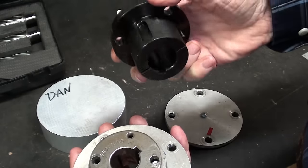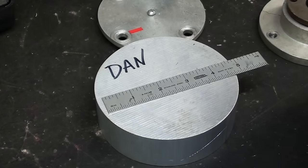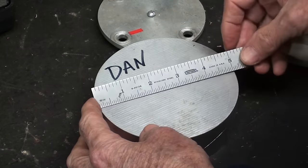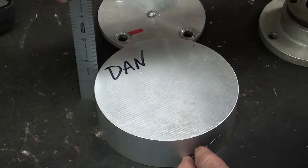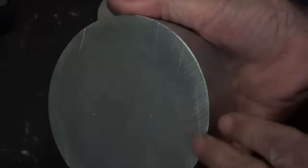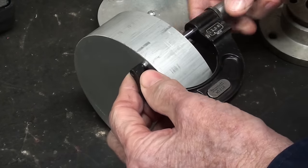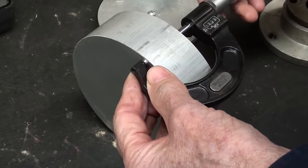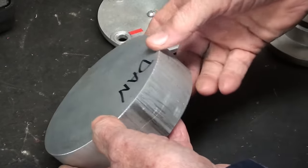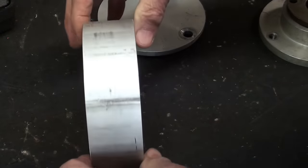He's got a new one of those too. One-inch shaft, and that's a three-degree taper, and this came from Grainger's. I'm not sure where Dan bought this aluminum, and I do not know what alloy it is, nor do I care, but it's five inches in diameter, one and a half inches thick, and this has been saw cut and it's just perfect. I went around and mic'd this in four different spots and it's all within a thousandth or two, so that's pretty amazing.